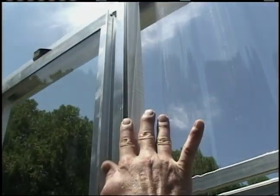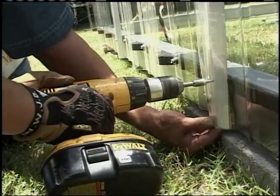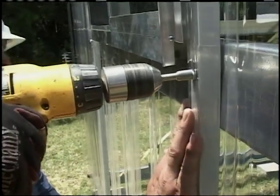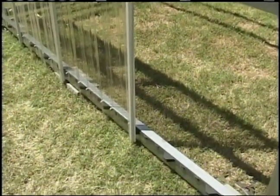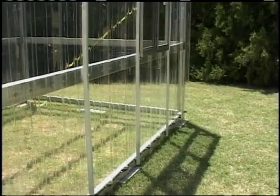The next panel is now lapped with the lap stiffener inserted on the inside of the lap. The lap stiffener is to help with the screw retention and lap strength. Level and plumb the panel and attach it with the appropriate fasteners. Repeat this until the entire wall is complete. As each wall is completed, the temporary bracing for that wall may be removed.